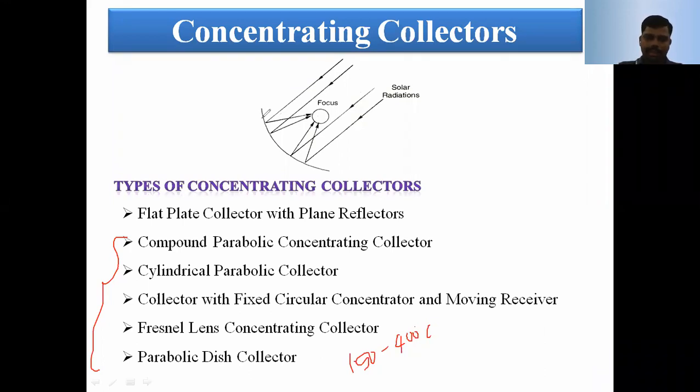But here, the PV panel materials are generally classified into three types: monocrystalline, polycrystalline, and amorphous. But here the PV panel material used is polycrystalline. In India, in almost all places, the material used is polycrystalline, because here the temperature is more. Up to now, any doubts?